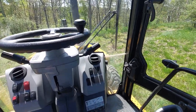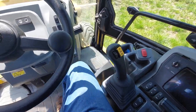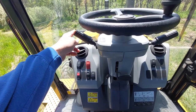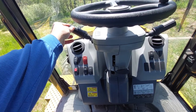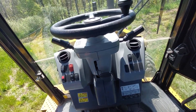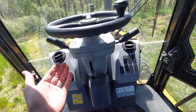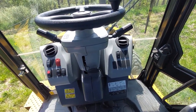A couple other things I'm not as crazy about: this is probably the same with all pilot-mounted controls, but if you're digging and go to turn around, you hit your joystick on the steering wheel. So you've always got to put the steering wheel up when you turn around — that's a little frustrating. The other thing I liked about the Case was its fully automatic transmission. You could put it in fourth gear, take off, and it would start in first and run up through the gears automatically. On a hill it'd drop a gear, and you could also bump the lever to drop down quickly going into a pile of dirt. That was really cool about the Case.